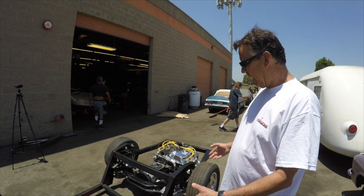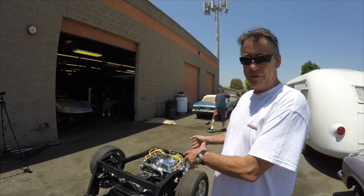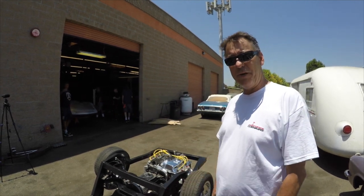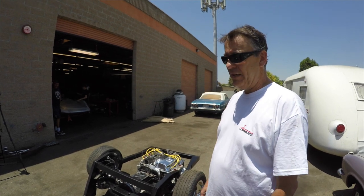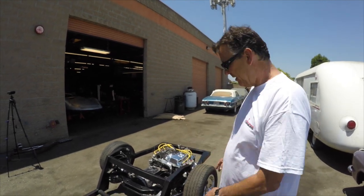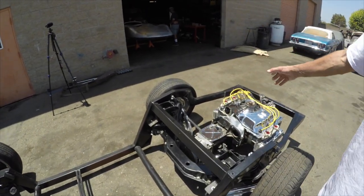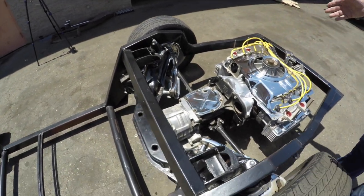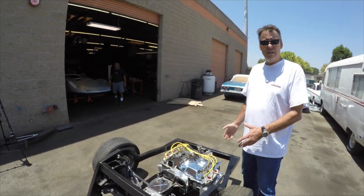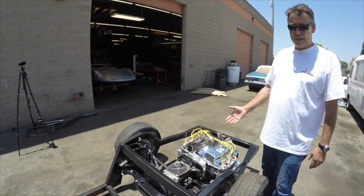Surveyors here in Chino Hills, California. I'm just going to speak a little bit about Bill Cushenbery, his choice on the Corvair front end, rear end suspension and drivetrain. I had never spoken with Bill, but I've seen similar things where they'll transplant a Corvair drivetrain and/or front axle suspension, usually because it is a very transplantable powertrain. The way General Motors designed this from wheel to wheel, the K-member, and the drivetrain itself was known as the Unipack. And the Unipack can be simply unbolted from any chassis and placed into any other chassis. I'm sure Cushenbery recognized that back in the 60s. We need a drivetrain that has some torque and some power and is very transplantable. And I'm sure that's why he picked the Corvair base to do that.